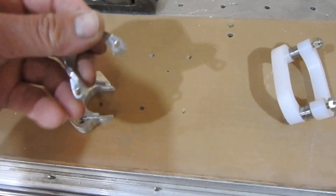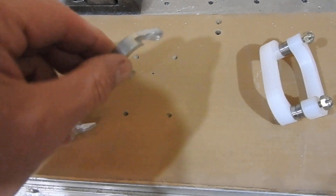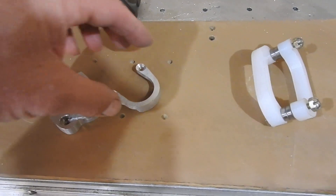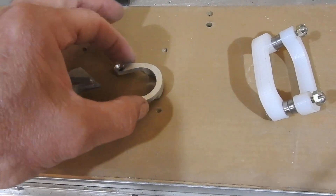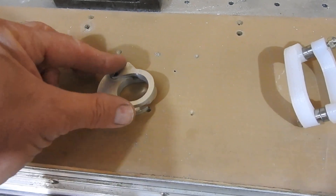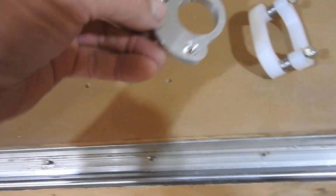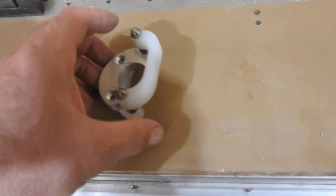This is designed to go around the torque tube because you can't get to the torque tube. And then this is the clamp. You can see these things are cut halfway through here — that's full width, three-eighths. And then here you can see the recess cut in that for this cam. So you put the cam on the torque tube, slip that on, slip this on, and then just bring them together. They're drilled for countersink screws. And that's the cam, which goes inside this cage assembly.